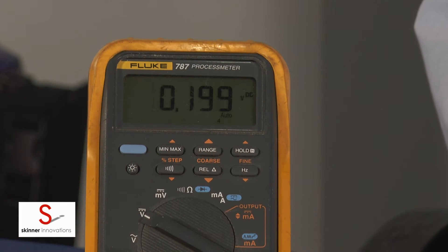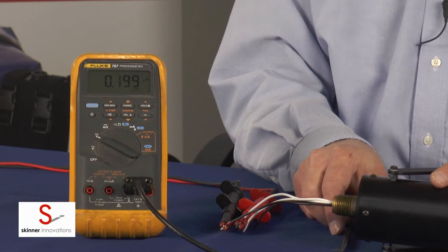The first trip will be our rate compensated trip — the one that was lower, which was about 150 on this one. This detector was heated up a little from a previous test so it may be a little lower than that. Then you would take your last four trips, take the average of them, and that would be your trip point for that detector.